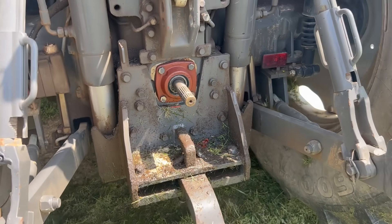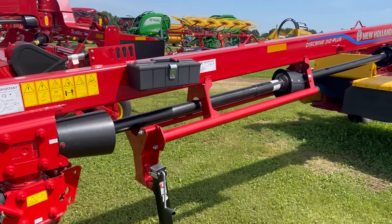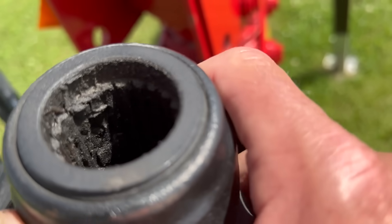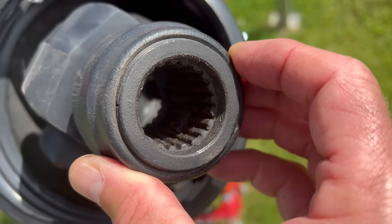What's the advantage of 1,000 RPM PTO? The 21-spline shaft can carry more torque, and you can have a bigger tractor. Because you're spinning almost twice as fast, you can carry the same horsepower with half of the torque — so you get a more efficient design. The bigger implements — big 20-foot brush hogs, big square balers, big round balers — almost all of them are 1,000 RPM PTO. The implement isn't running faster; it has a different gearbox that gears it back down. But getting power from the tractor to the implement is more efficient with 1,000 RPM PTO. It's too bad the industry couldn't have switched entirely in 1958, but there were thousands of 540 RPM implements that would have had to be modified.